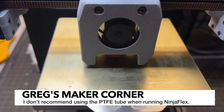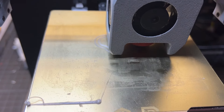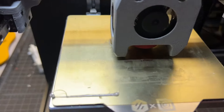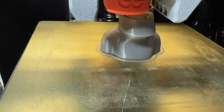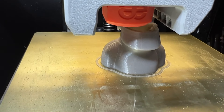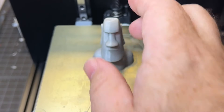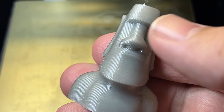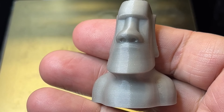I'm going to give NinjaFlex a shot here — this is definitely some of the most challenging TPU to print. The recommended settings say I can go retraction 3mm, which is kind of long for a soft material, but I'll give it a shot. Unfortunately, the PTFE tube was getting really bound up with the filament and started skipping, so I went ahead and tried it without the PTFE tube. Everything is still looking really good on this NinjaFlex print — the layers are looking just really nice. The Moai has finished, and quite frankly this is probably one of the best NinjaFlex prints I've ever seen on my printer. Zooming in, you can see just how consistent it looks — no gaps or anything.